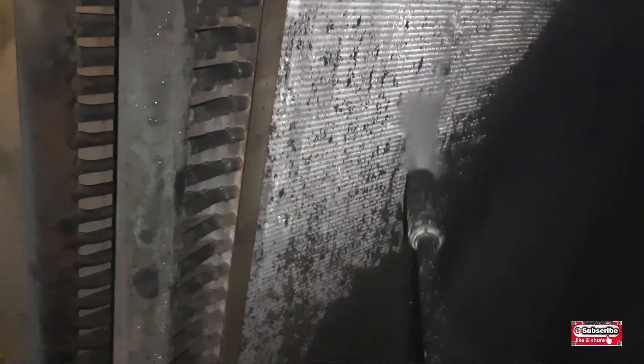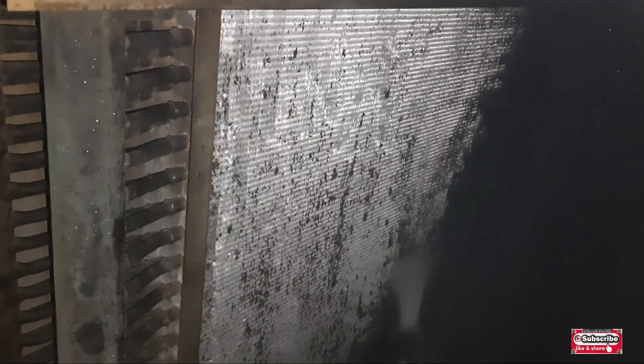Even if you are not opening this every 2 months during every preventive maintenance, it's better to clean it every 2 months. But if you are not opening it in 2 months, you must open it every 6 months because you can see how much dirt is inside. When we wash from the other side of the coil, the dirt drops down onto the cooling coil, and that's the problem causing your system to not cool sometimes.